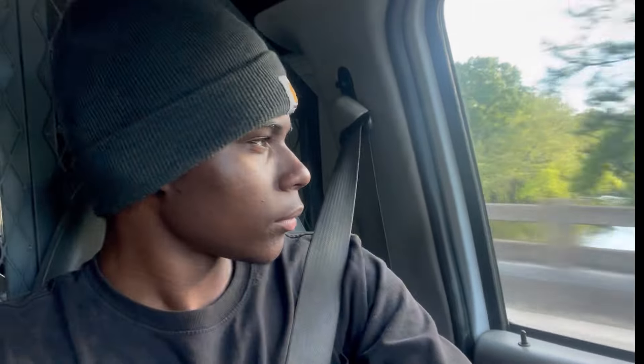Yeah, that's pretty much it — just helping out a tank. The rack was super low on gas. With the sight glass, you could barely see any liquid going through — it dried out. We added gas, but first we searched for the leaks before we added gas. His manager right here, he's very particular — he wants to know where his gas is going and what's going on with the cases. He's a really cool manager. We talked with him about the pressures and all that. We did a store walkthrough — leak checked first, added gas, then did leaks inside the store and coolers.